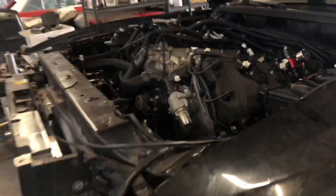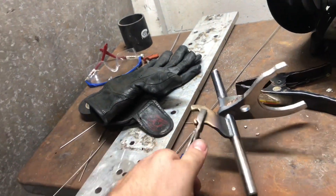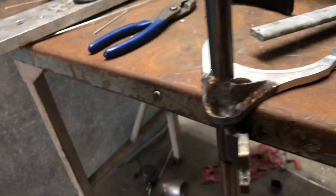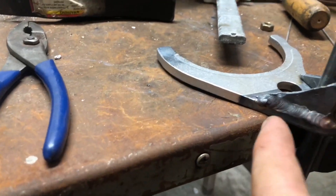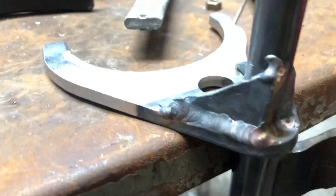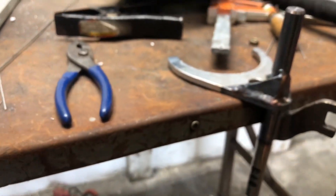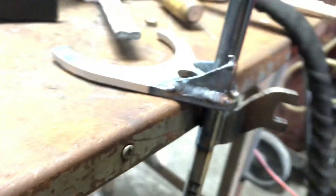While Ricky's working on Nick's Mustang, I just finished up welding this fork. I'm not as good as he is welding, not even close, but there are a few things I could work on. He said some spots were a little hot, a little cold on others — just get more consistency and not use as much heat when it's not necessary for smaller stuff like this. As you can see, it's all welded up and gusseted. We're not going to do the inside because it penetrated well from the outside, and some people weld gussets on the bottom as well — that's totally up to your discretion if you want the extra security.